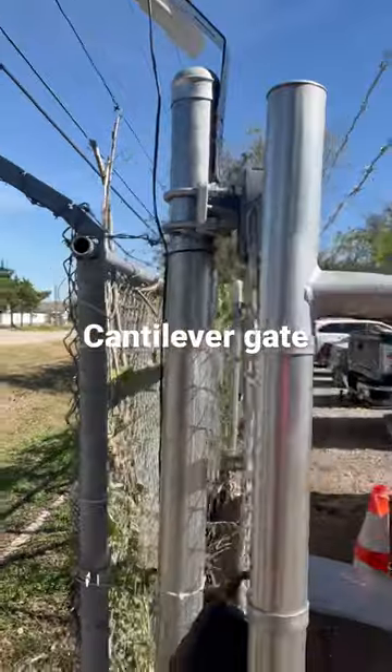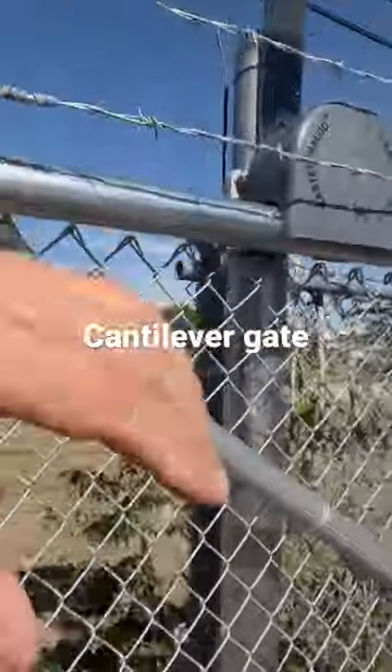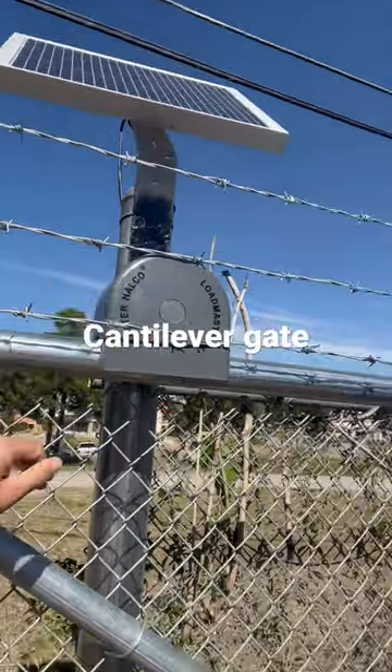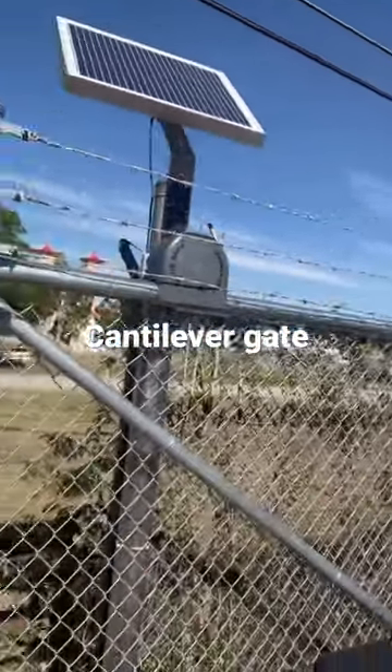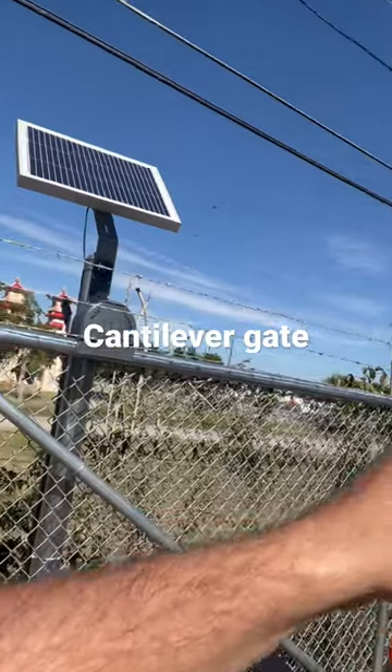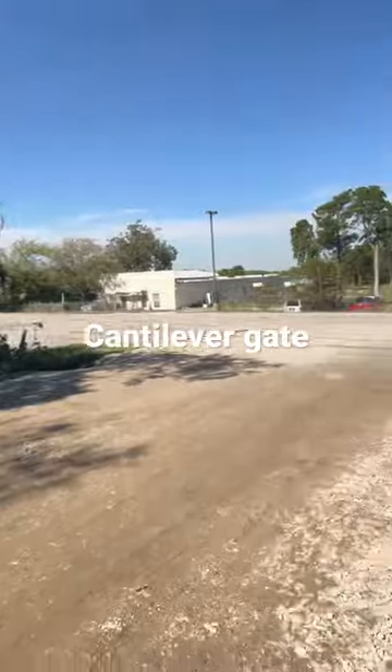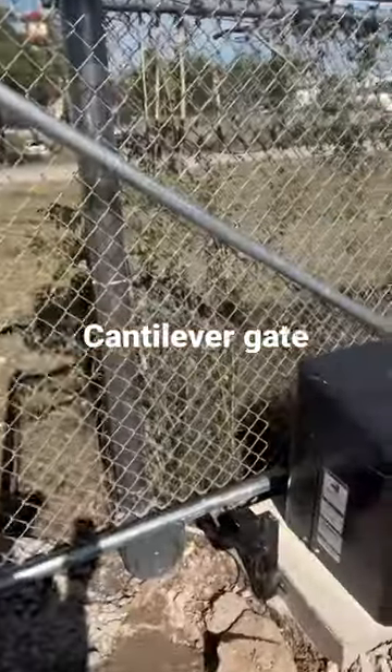So it's got the safety roll gate wheels by Master Halko. Got four of those to build out the cantilever. So it's a 30-foot opening, so the spread on the post is 15 feet. It goes all the way across over here and latches, and opens up daily with the LiftMaster.